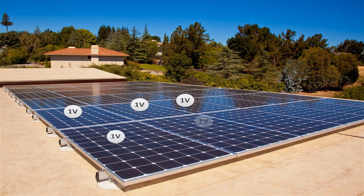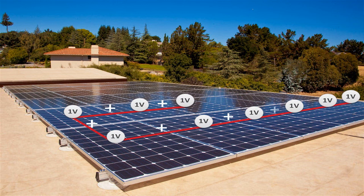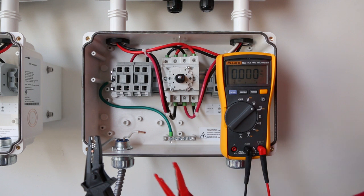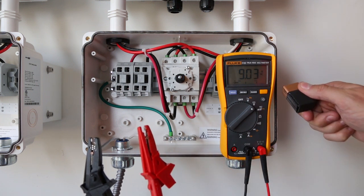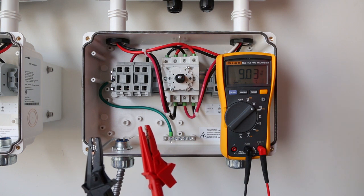Optimizers output one volt safe voltage prior to the inverter — I'm actually commanding them to export power. Since voltages add in series strings, we can measure the number of modules we have in each string. So in this example we have nine modules, and as you can see, our DC volt meter is displaying nine volts.